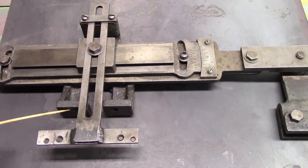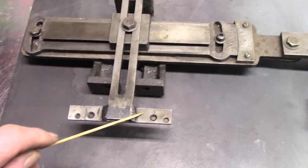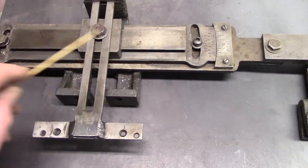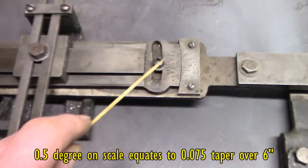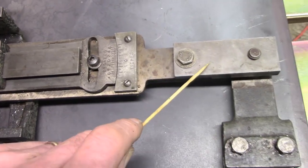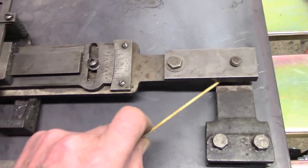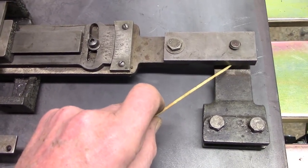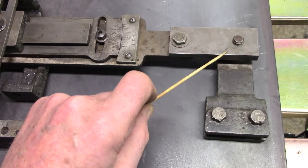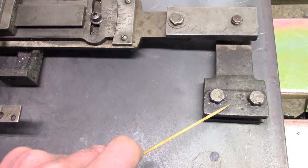This casting here attaches to the end of the saddle. This attaches to the cross slide - it's adjustable, you've got an angle setting on here. This end actually has an extra piece which is packed up by 4.45 - I'm not sure whether it wasn't actually designed for the Little John originally - but anyway this is made to allow for an offset of height.